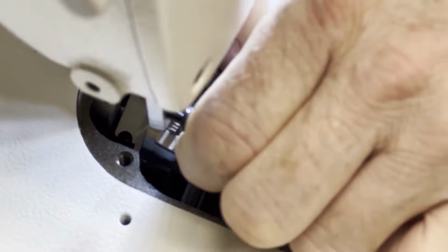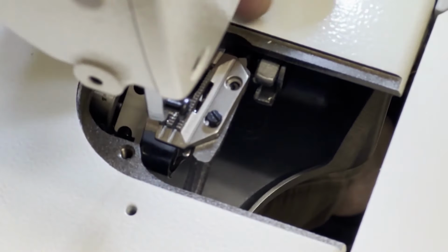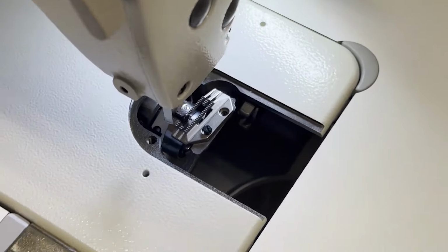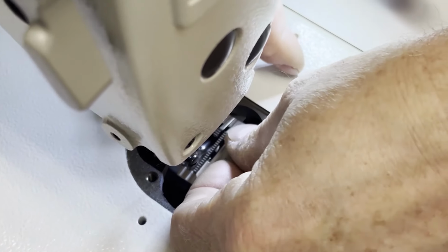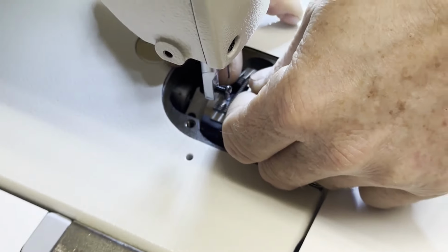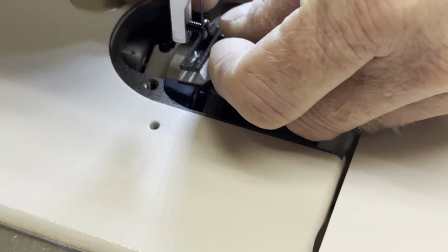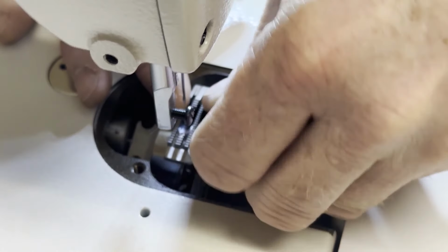Basically, there's a lot of problems that can happen while sewing with a Juki DDL-8700 or whatever machine you have. And this video is more or less an encouragement and a little bit of a how-to on taking apart the basic elements that you need to investigate and what a possible problem may be when the thread is breaking. So we've already outlined 2 issues.